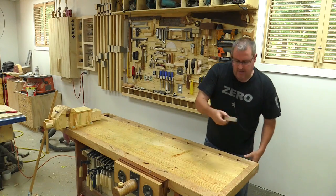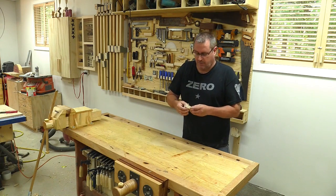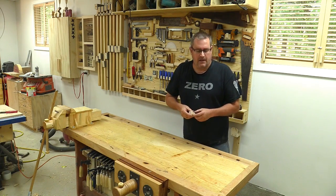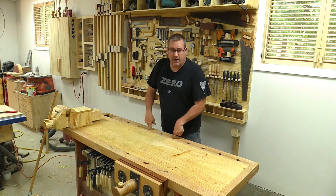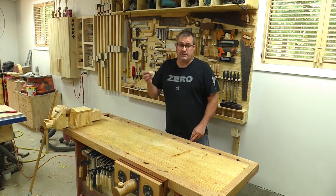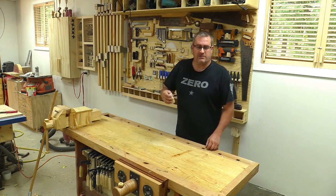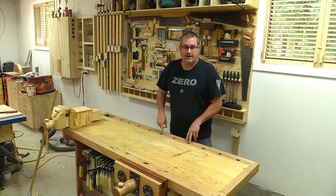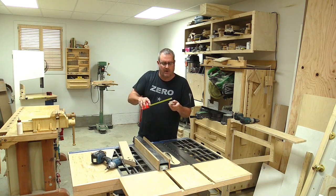While I'm at it, I thought I would make a couple more of these — bench dogs, wooden ones. I lost one; I had two but they're not difficult to make. I have a problem with dirt going down into the dog holes and landing in the drawer. I've got nine holes but I certainly don't need nine bench dogs, so I figured I might as well make plugs that fit the dog holes too. The stock needs to be one inch by one inch.